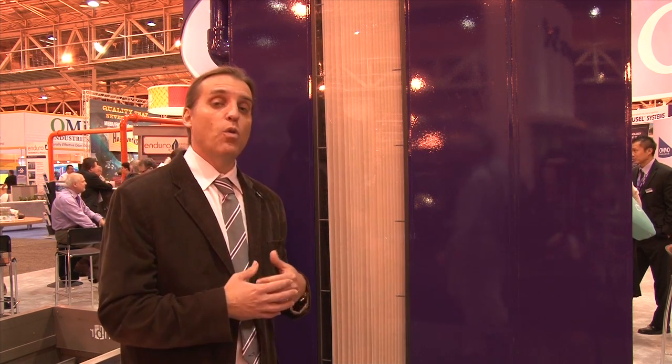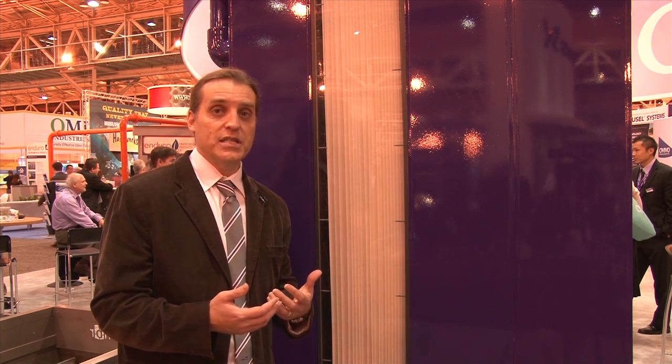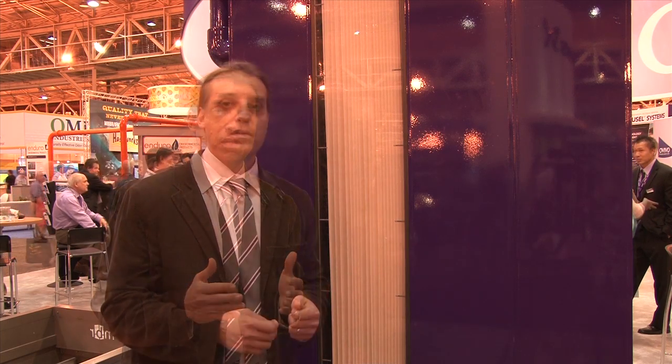What you see here is one permeate module consisting of four cassettes. Each of these cassettes has 25 membrane sheets. Membrane flat sheets are slightly different than membrane flat plates in that there is no rigid plate supporting the membrane material. Instead of a flat plate, it's a pliable or flexible sheet — specifically, two membrane sheets fused to a common plenum material made of polyethylene that is flexible or pliable.